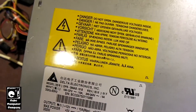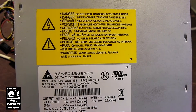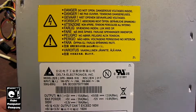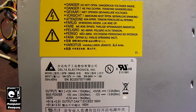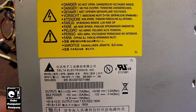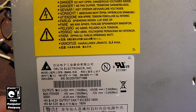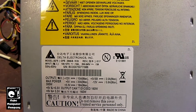First and foremost, when it comes to e-machines computers, they're highly known for the infamous motherboard-killer Bestech power supply, model Bestech ATX-250-12E. Bestech has a pretty bad rep because of that one model — it was highly known for killing motherboards. When its 2-transistor 5-volt standby rail would malfunction due to failing capacitors, the 5-volt standby would skyrocket to sometimes 12 or 14 volts. I have it on video. That ATX-250-12E is the one highly known for that.